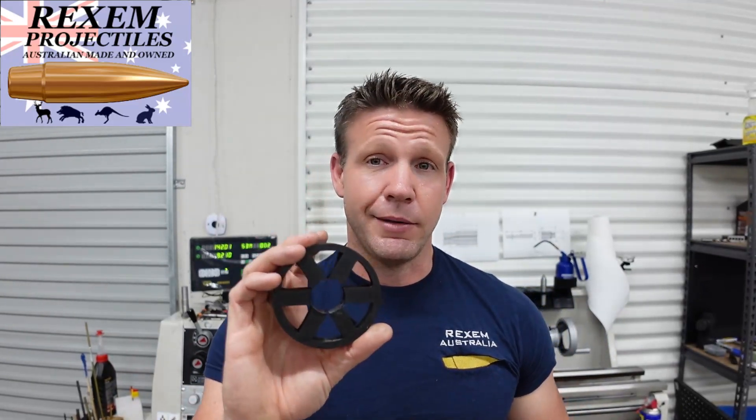To help me do that I needed to true up this six-jaw, because the three-jaw is okay but it also had runout — I'm going to have to true that up as well. All I did was use this 3D printed part and machine it with a 16 millimeter carbide boring bar. I'm going to show you how I did that, and then show you on the dial indicator that we're running out less than 0.01mm — the needle barely moves, it's only about 0.005. I don't have an indicator that accurate but I will probably get one to prove it.